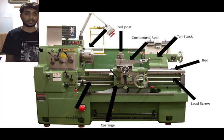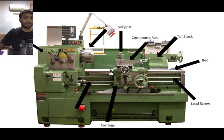Turn on the lathe and engage the half-nut. Take a scratch cut on the part without cutting fluid and disengage the half-nut at the end of the cut. Stop the lathe, back out the tool using the cross-feed, and return the carriage to the starting position. Using a screw pitch gauge or ruler, check the thread pitch. Feed the compound in 0.005 to 0.020 inch for the first pass using cutting oil. As you get near the final size, reduce the depth of cut to 0.001 to 0.002 inch. Check the size using a screw thread micrometer, a thread gauge, or the 3-wire system. Finally, chamfer the end of the thread to protect it from damage.